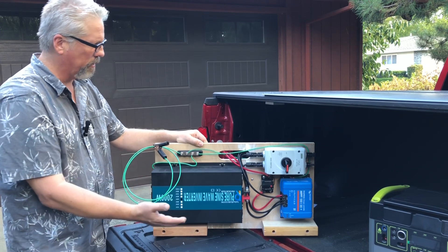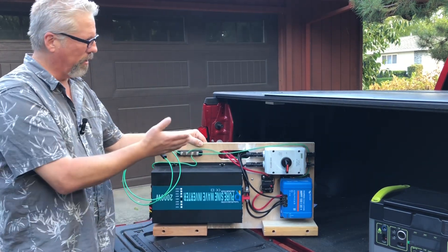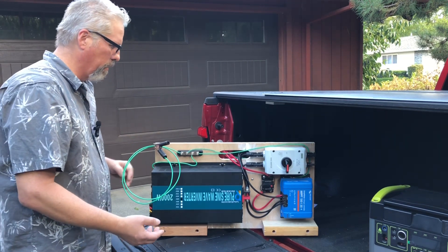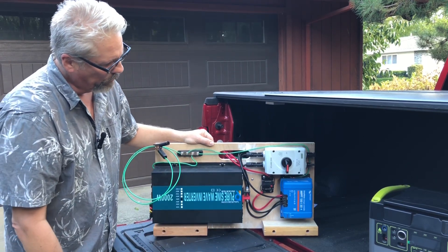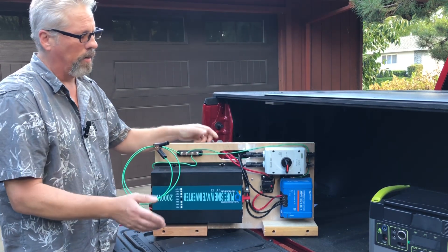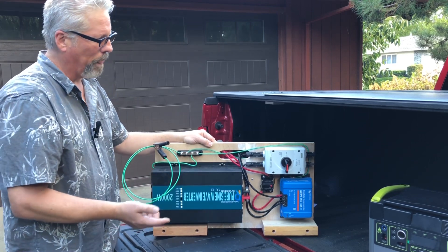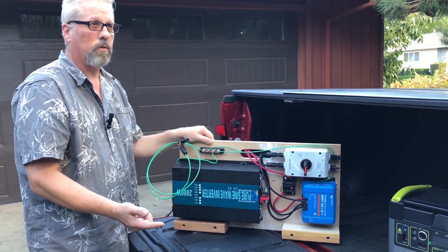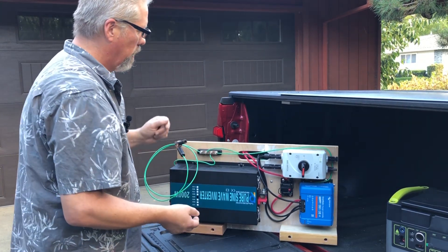I just put together this board and attached these things to it. This is not going to be how it looks in final form — in final form it'll be mounted to the truck somewhere and grounded properly. Right now I just have this lead that goes out so that you can connect chassis to ground. This is a Victron Smart Solar MPPT 150/35. I wanted to get the 45 which will allow 45 amps out to a battery bank, but this 35 was on sale so I picked that up. It should work fine for now — technically this can go up to 2000 watts of power. From the solar panels it'll take up to 150 volts, and the higher the voltage, the more power you get for the same number of amps.